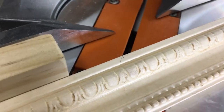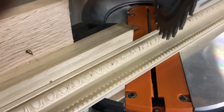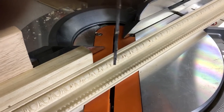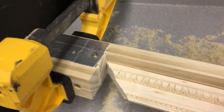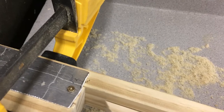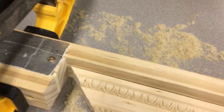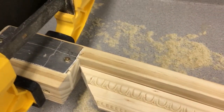Here's the mark on the saw, and here's the blade. I just line up the mark with the saw blade. On the other end I have a stop, and I simply slide the board over to the stop — a little bit tricky — slide it over so it hits. And the stop stays in place while I cut the other piece.